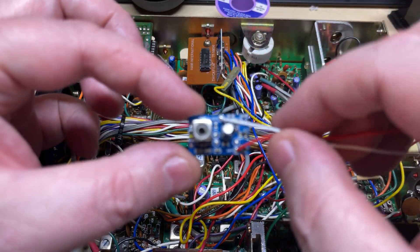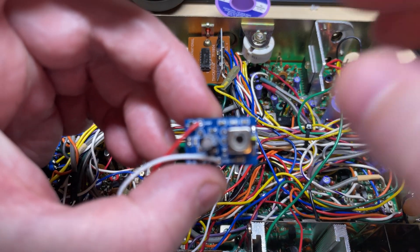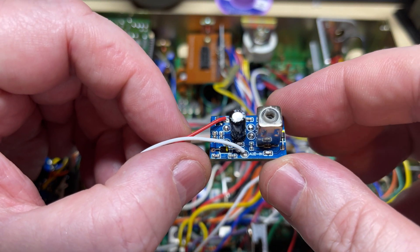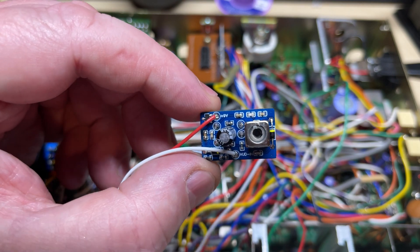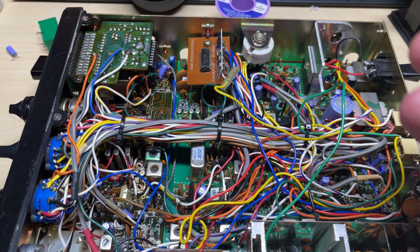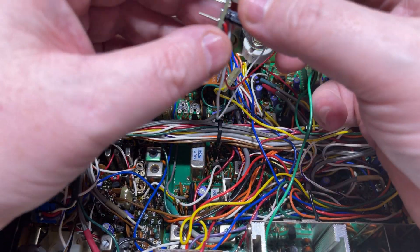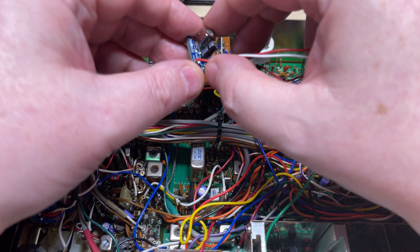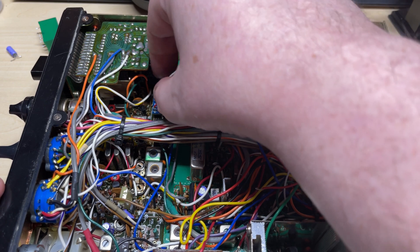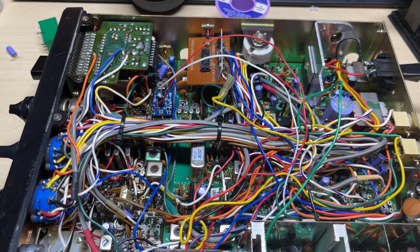This VCO has got two extra wires on it: one for the voltage feed point, and one for the FM audio modification. This VCO board has the components for the FM audio mod — thanks to Dave Cubwolf for these. We're going to install the VCO into the radio, observing the correct pin orientation, so the VCO should just drop in like that.